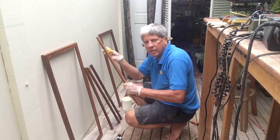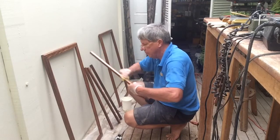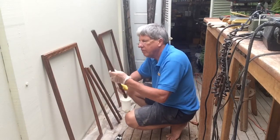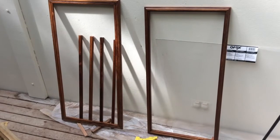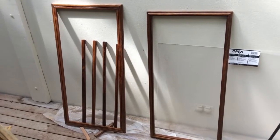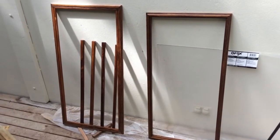Now we're going to rub it down with a piece of cloth. This gives you a rubbed finish, which is really what we want — it's almost like spraying it on, you really get a very even finish. We did a very light sanding with 800 paper and corrected a few little errors. So this is painting coat number three.